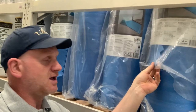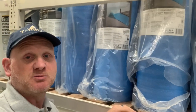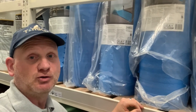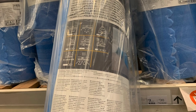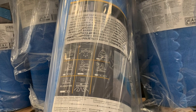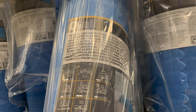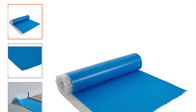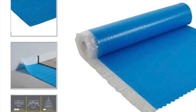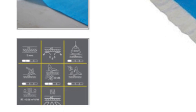This blue polyurethane foam underlay is moisture resistant, so this could be used with bathroom stuff where you've got moisture-resistant laminate flooring. This underlay can be used in any room and is also good for underfloor heating. Basically it stops any moisture-related problems arising from a concrete subfloor, improves walking comfort, reduces footfall sound, insulates from the ground to prevent rising humidity, and levels floor irregularities of up to two millimetres.